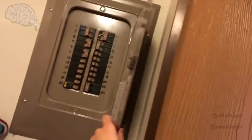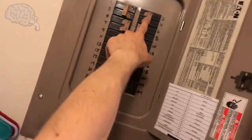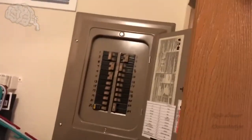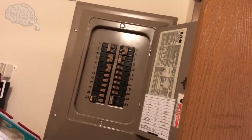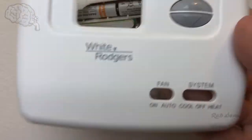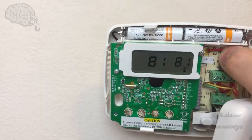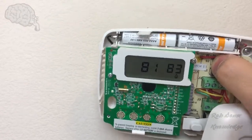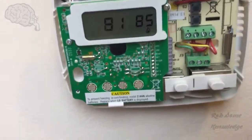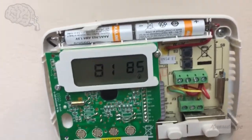Make sure you are shutting off the power to any of your heating or cooling systems. I have the AC shut off and the furnace shut off as those are the two systems that I have. Make sure you shut off all the power to be safe. One way to be sure the power is cut is to turn it to heat and set the temperature higher than the temperature in the room so it would normally kick on, then just wait a minute or so. If it doesn't kick on then you know the power is cut to it. And obviously make sure you do that in the breaker box first too.